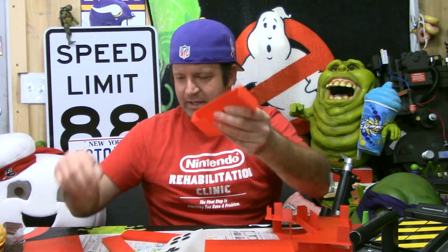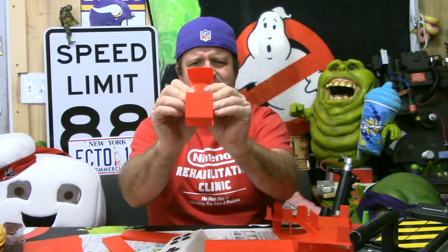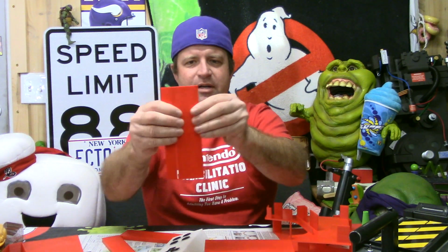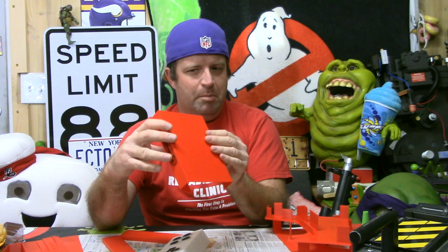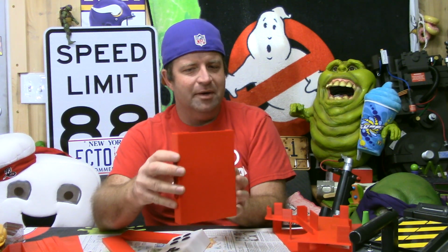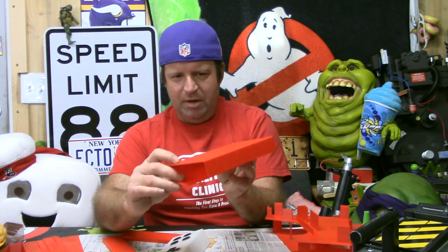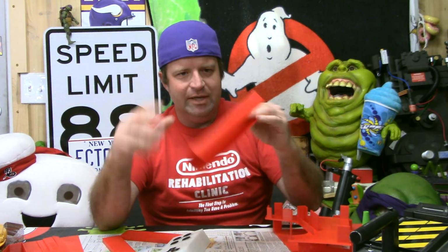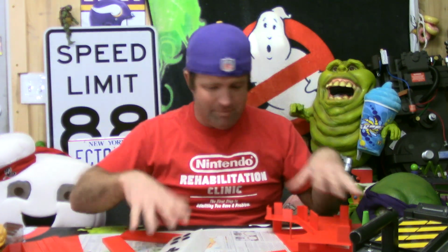Here you can see pieces of the original lid, and they separate. You see that? In here too, I printed it at a different angle, and it just kind of comes apart. I think if I forced it enough, this would still come apart, but this was an 11-hour print, so I don't want to wreck it. It's usable right now. But I think it was a problem with my printer and not with this. I turned up the heat for this part, and it seemed to melt the layers together a little bit better. I may or may not go back and do this in the future. I'm still waiting for the parts to fix my printer, at the time of this video anyway.